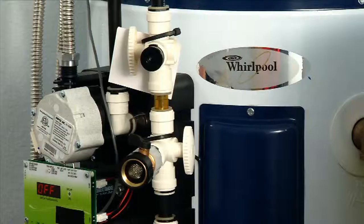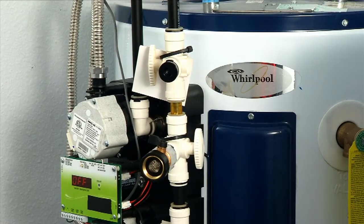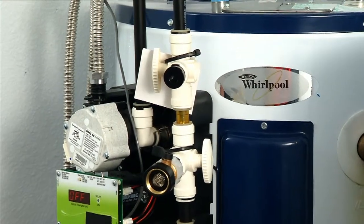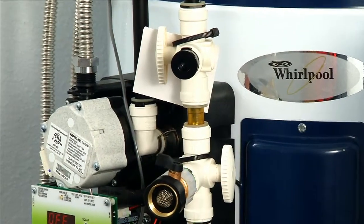At this point, verify both valve handles are in the operation position with the handles oriented vertically in line with the tubing. Verify the plug is installed in the fill valve and the locking clip is installed. Finally, verify the fill adapter is installed in the drain valve and a locking clip is installed.